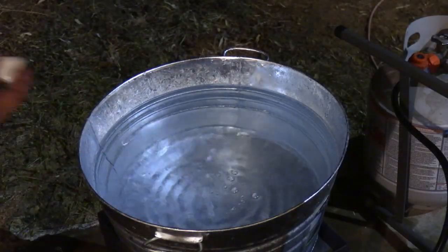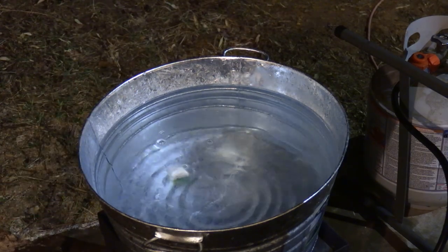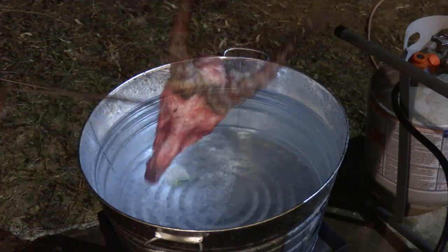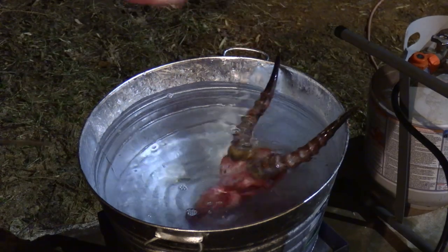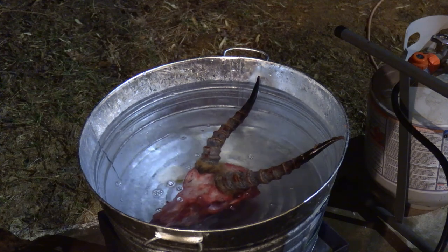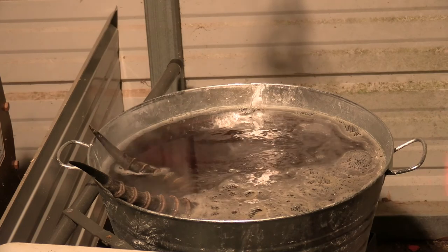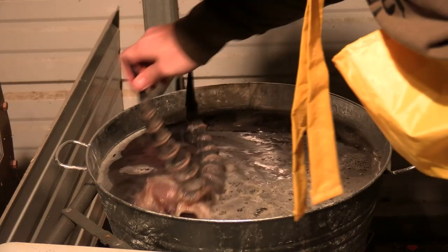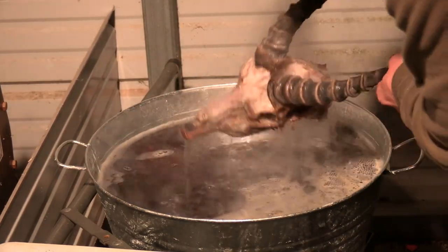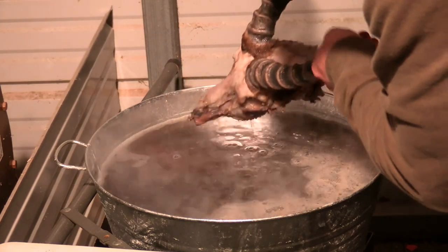The boiler that I'm using for this process is a propane burner with a galvanized bucket on top of it. I got about five gallons of water in it and I put two little packages of dishwashing detergent in there — the kind that are made to specifically cut grease, they work really really well. I let those heads boil for the first time for about 30 minutes. Once they've boiled for about 30 minutes, I bring them out and I give them their first round with the power washer.